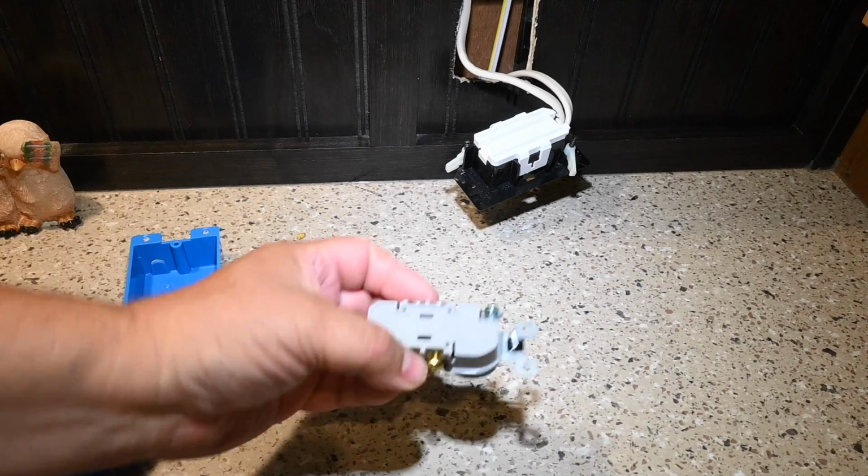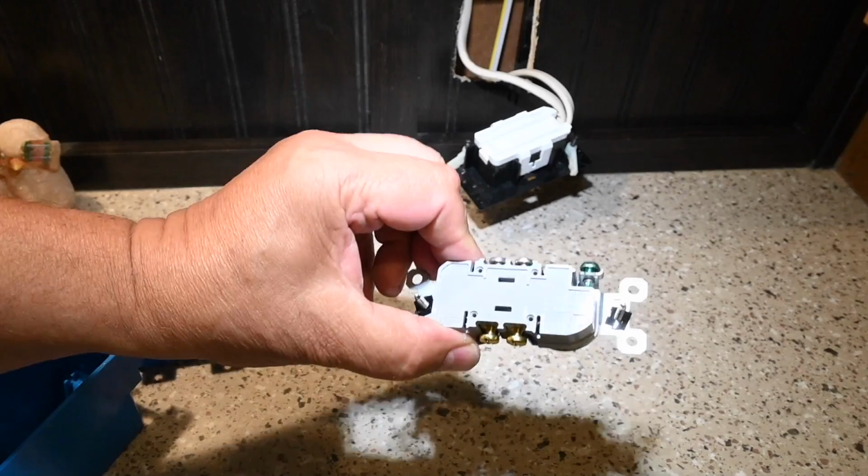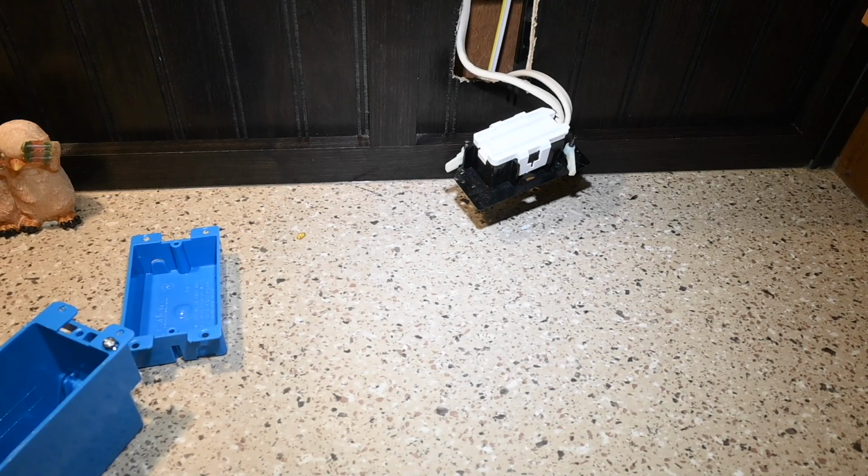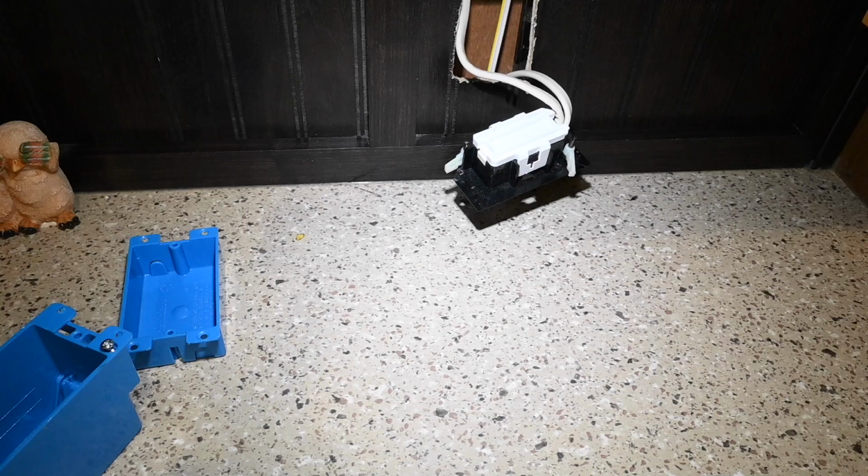And the other problem I have is these outlets themselves. There's a little hole you push the wire in, or you got to wrap a wire around this post, and that's beyond the ability of some RV owners to do. So actually, in my view, the Wirecon connectors protect the wiring better than the residential boxes. Because remember, the residential boxes are designed for a building that doesn't move around, and the Wirecons are designed for RVs and mobile homes. There's probably less chance of the wire snapping off in the Wirecon box, the way that the Romex is held secure on the back side, than there is with a standard box. So I have no issue with using the Wirecon outlets, provided that they're installed correctly.